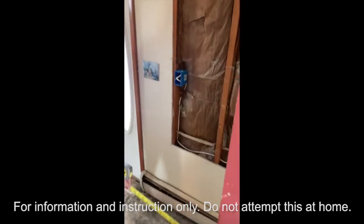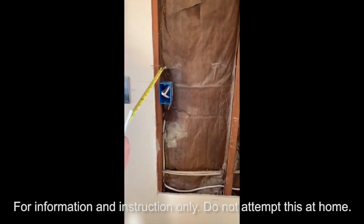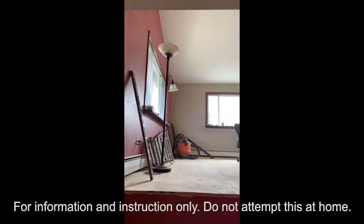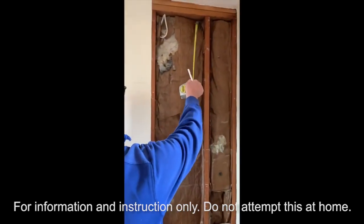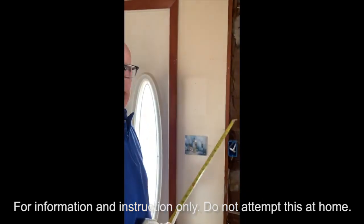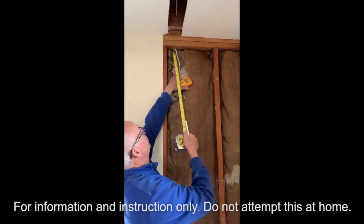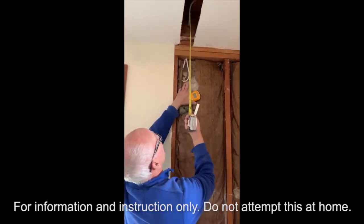Here's the switch box right by the front door, and this is your three-wire wire coming across into the box. We need to add a 14/2 wire from this box to the fixture up in the dining room ceiling, but it's not installed yet. You have to figure out how to do that with minimal damage, so you want to know where your studs are — cut the sheetrock on half a stud so it's easier to patch. I already drilled up through the double top plate across the floor joists.